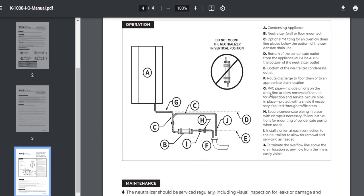I did see this drawing — for those of you on a podcast, I'll try to describe it. It looks like a boiler, or maybe just any condensing appliance. They have this neutralizer down there and it runs through as a lower drain line. It has some unions around it, so you can change it out or add new base material to it. Then it has another condensate tube that goes over the top, because I'm assuming these things clog up and the condensate has to have somewhere else to go. Some of them are filled with little pellets, and it looks like they would clog — maybe I'm wrong, but it looks like they would.